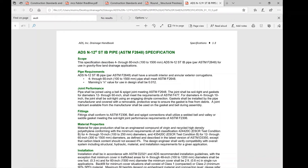Because of the differences in smoothness, we get differences in the roughness coefficient — that 'n' value. These values change based on the type of pipe you're designing for, so you always have to know what pipe you'll use. The specific pipe manufacturer will recommend an n-value, but municipalities also have the ability to change that n-value based on what they think is best.